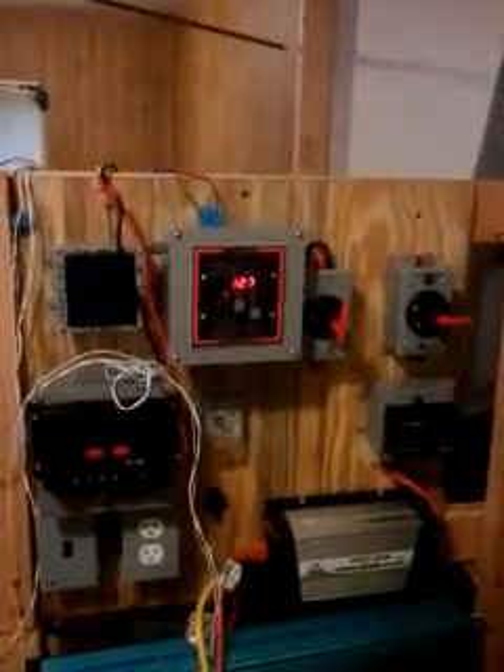I chose to wire mine at 15 volts, given that my configuration is a 12-volt system. If you're familiar with battery systems, you realize that when a battery is charging, the voltage has to go well above the standard 12 volts for the charging process to actually take place. It needs to break down the sulfation, get the chemicals blending again, and obviously desulfate the batteries.